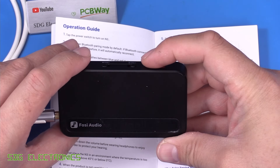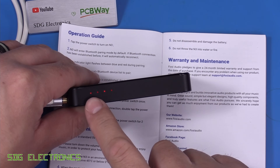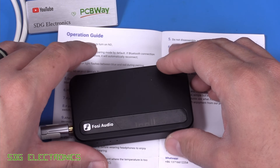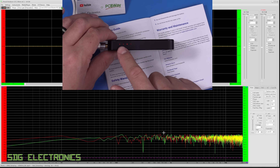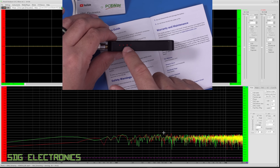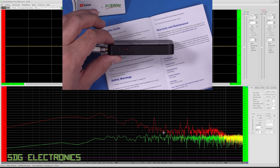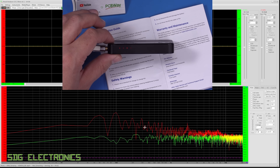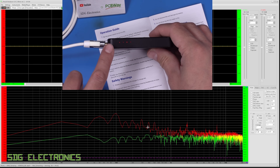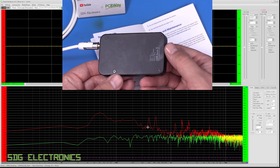According to the user manual, we power it up and start the pairing process by holding down the power button. The full battery indicator shows, and then the flashing blue light means it's ready for Bluetooth pairing. That's paired okay — we've got four red LEDs which indicates 100% battery, though the illumination is pretty uneven; one is a lot brighter than the others. If I play audio on my phone and look at the spectrum, we can see we're only getting audio coming out of one channel. The other thing I've noticed is the audio jack seems to be at quite an angle, so we might just have a simple problem with the 3.5mm jack.